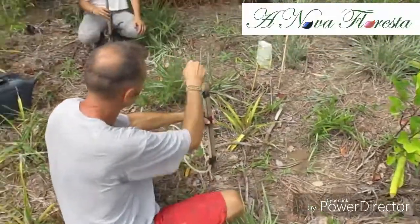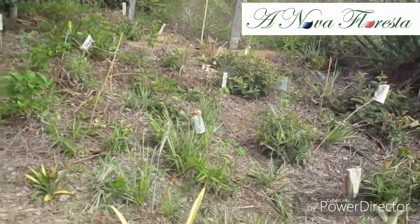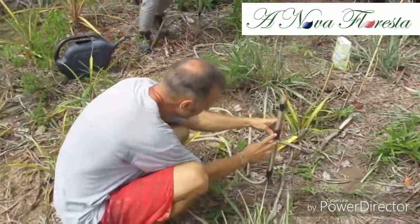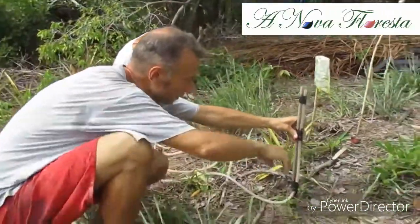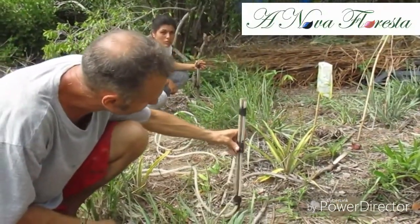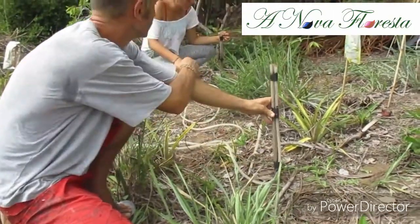We have to make a series of points to mark the horizontal level. On one side we put it down on the floor, and on that side I will see where the level is. Here it's good. If I would go here, it would go down. If I go here, it would go up. So I have to move the level until I find exactly the right spot. Here is the same level as that — it's horizontal.